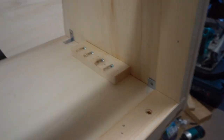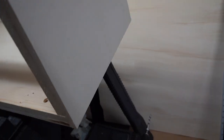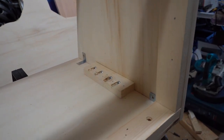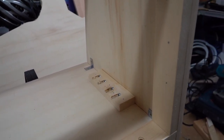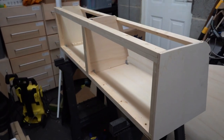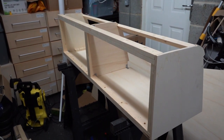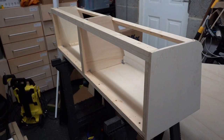And then along this joint, which is basically ply and ply, 12mm, I wanted to keep it completely clean on the outside there, so no screw marks or anything. So I basically pocket holed in a little piece there, and then nailed it through to the piece of ply below. So it feels nice and sturdy. Hopefully it'll be okay, but it certainly looks like an upper cupboard, so I'm pleased with that. So I think the next stage, we'll take it back in the van and just make sure it fits as intended. Then I can start sanding it and prepping the wood, ready for painting.